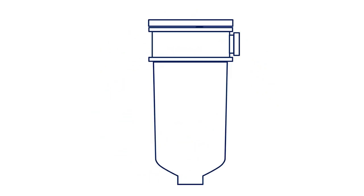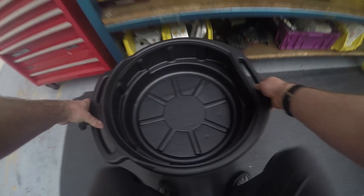If the bowl is situated above the head, excess fluid will leak from the filter as you loosen the bowl. If possible, locate the filter with the bowl underneath the head so most of the fluid will be held within the bowl as the element is removed. Ensure you have a suitable drip tray or spill kit to collect any excess fluid.